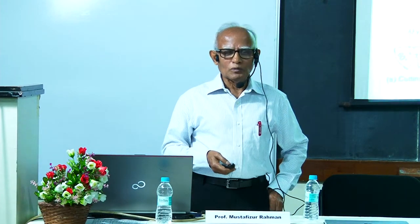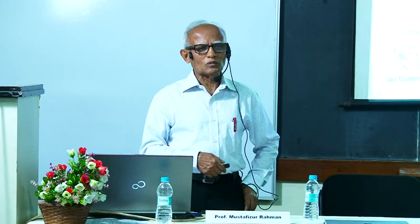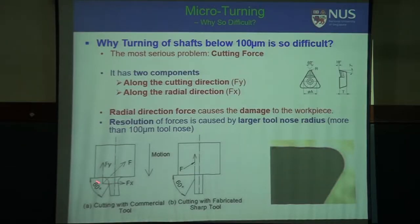when we could not go below 50 micron, I think we spoke about it, we have to think why we cannot go below 50 micron. Because the edge radius was causing the radial force. We tried to remove that because it is polycrystalline diamond. We could do it easily.